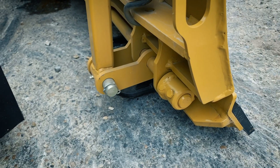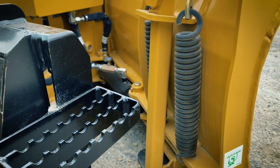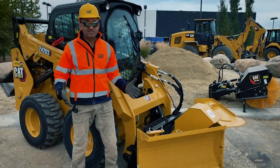These trip edges hug the contours of the surface and minimise plowing interruptions. In addition, on the rear we've got adjustable spring tensioners which adjust those trip engagements. And for safety we've got that bolt-on serrated footstep here, because they get knocked off very easily.